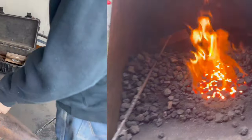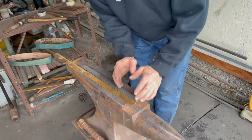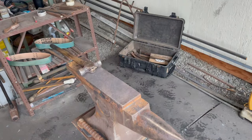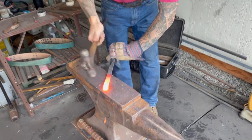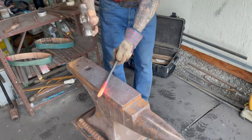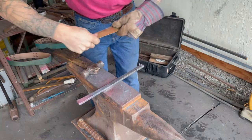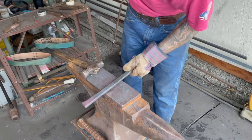Let's get some steel measured. So 15 inches, and I think the ticket's gonna be we're gonna start by just bumping up this frog plate and building the frog plate by bumping it and gathering it up to make like a triangle. So we'll start with that first. Start bumping it up. See what we got bumped into that one heat. It's only 3/4 of an inch, so we gotta keep going.